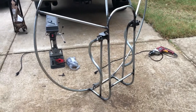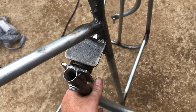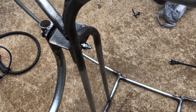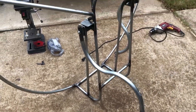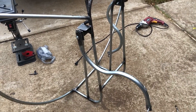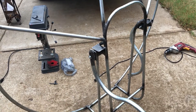It's finally starting to look like a paramotor. I've got the arms attached, welds done, and a bolt running all the way through from the outside to the inside with double lock nuts to hold it on. I might have to shorten that bolt a little depending on where the motor mounts end up. Next step is to get the last two spars in, then improvise a cheap harness to sit in so I can do a hang test to see if this thing can handle holding my weight and the weight of a motor.